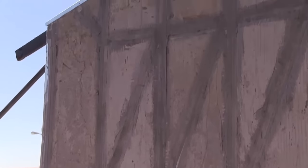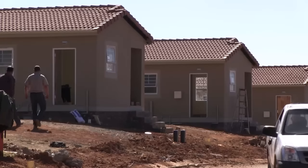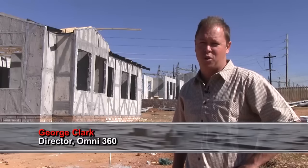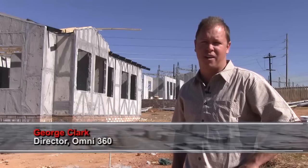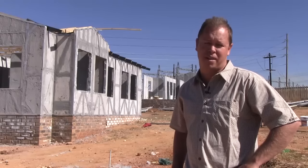It's a simple process of just filling the panel and letting it cure. It's left to cure for three days, then we move it out of the yard. It stays there for another two days for full cure, and then we move it up to the site and erect the panels. In the background you'll see that we've done plinth construction and we basically tilt up the panels to form the superstructure for the houses. You'll also see buildings in the background in various stages — this is panels going to site in its most basic form.